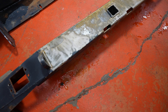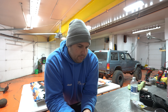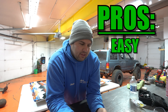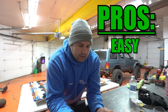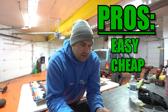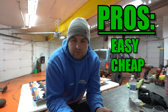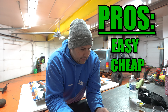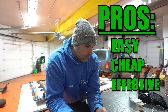It would take forever going through all this with a wire wheel or a grinder. So that's pretty much it — here are my pros and cons. Pros: it's definitely easy — just hook it up to your power washer, stick the end in the sand, and have at it. It's definitely cheap; the tool itself was about 30 bucks and we went through about 20 bucks worth of sand to get roughly 50% of the way done. It'd be even cheaper if you got sand from the beach, though that's probably illegal. It's effective — it works good when it works. It takes the mill scale off, the paint off, the primer off, everything all the way down to bare metal.